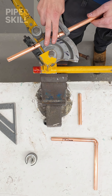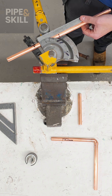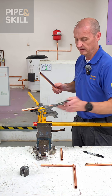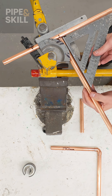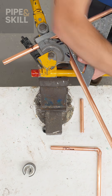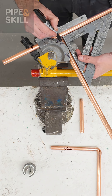50 mil guide, 50 mil wheel — put the guide in and that holds it. I get a spare piece of pipe and a right angle of pipe, in the right angle, in the wheel. Hold it 90 degrees and what I'm doing is I'm lining the mark, which is 190 mils in, to the centre of the pipe.